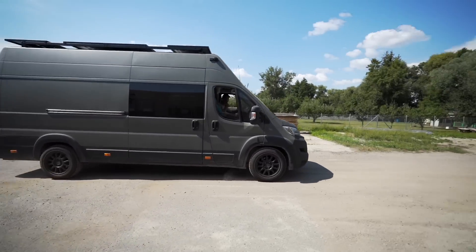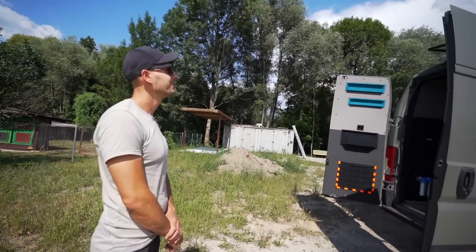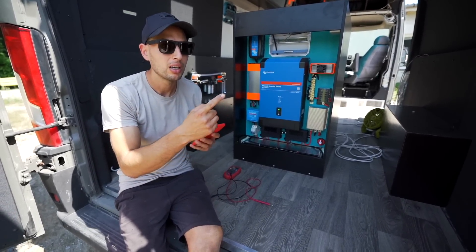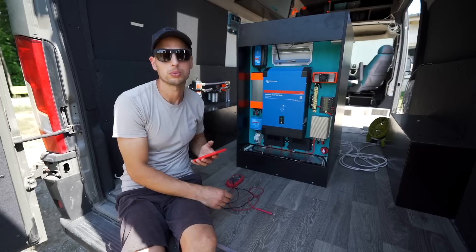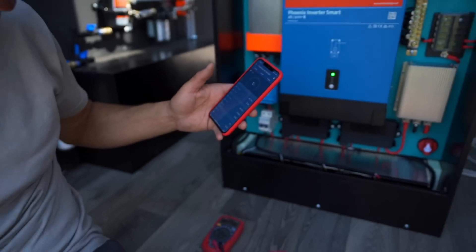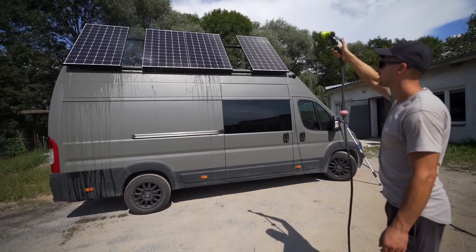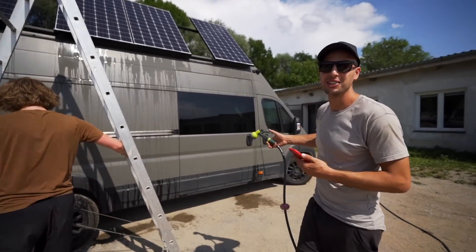It's time to press the magic switch one more time. Initiate the lift — there it goes. I learned much later that the voltage of the solar panels must be 5V higher than the battery. I was checking the voltage; if it was not I would have to change the connection from all parallel to one series. No current going there — they're very dirty but I see an increase in power. I think it's time to wash them. Last time we gained 100 watts by washing one solar panel, so there's ambition it might work out.